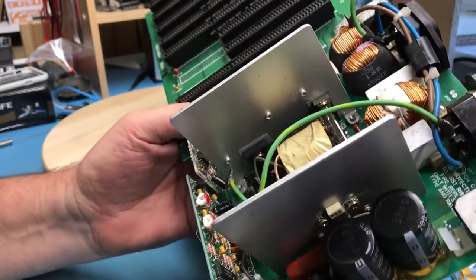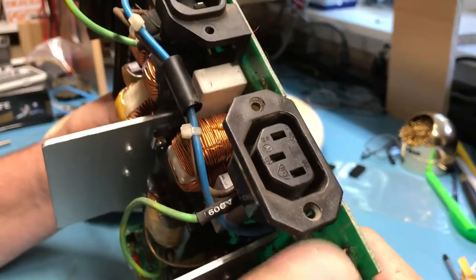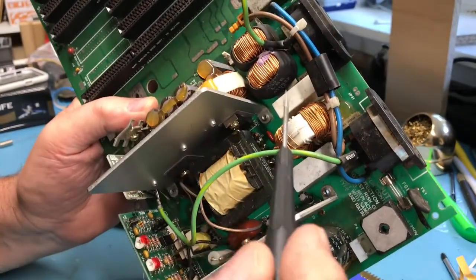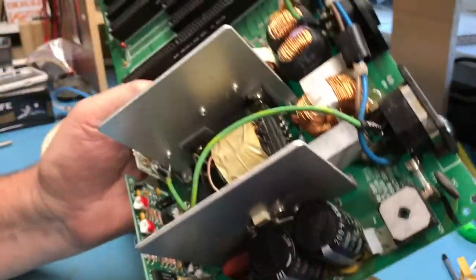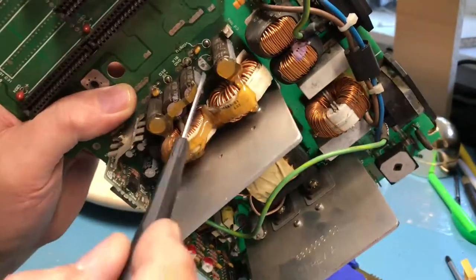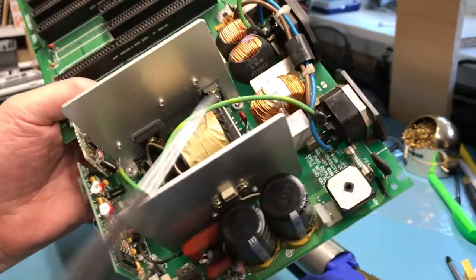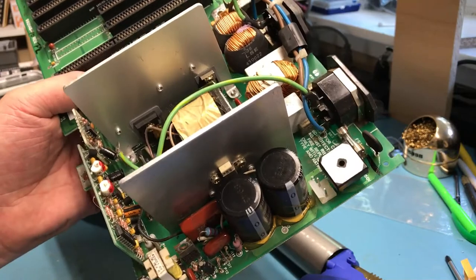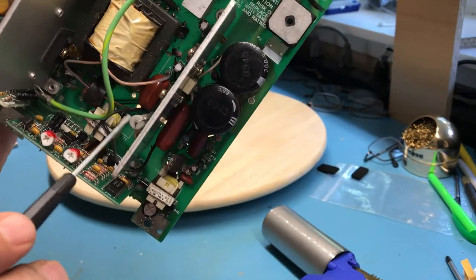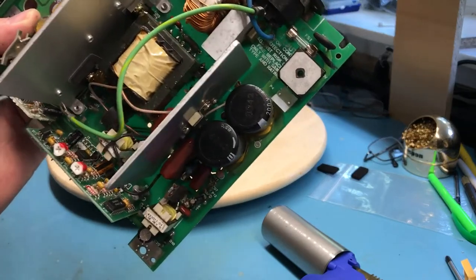There's a fuse here I'll probably pull. There's a MOV sitting here I will probably pull and hold on to — it hasn't exploded so it's probably in good shape. There are some larger caps in here I will ignore. There are all these toroids — five large ones — I will pull those and hold on to them, not necessarily because I'll reuse them, but the copper wire out of them can be useful if you need to wind your own coils or just need a strip of copper wire. The transformer really has no value to me. There's a large power resistor back here that I will pull, and if the resistance looks in spec I'll hold on to it. There are some smaller one-watt power resistors I may go ahead and pull as well.